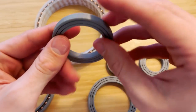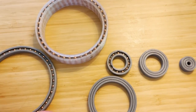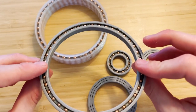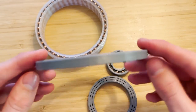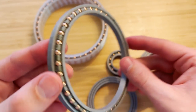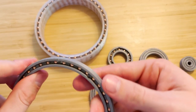In comparison to the one that wasn't run for 24 hours, there is virtually zero play in that one. This one was run for 12 hours and had the full brunt of 25 pounds on just one single blade. When I push it, I can definitely push it out — you can see it's itching to come apart and is very easy to pull apart. So this would definitely have to be supported; it still functions as a bearing, but clearly one layer thick under that much weight for 12 hours is pretty flimsy.